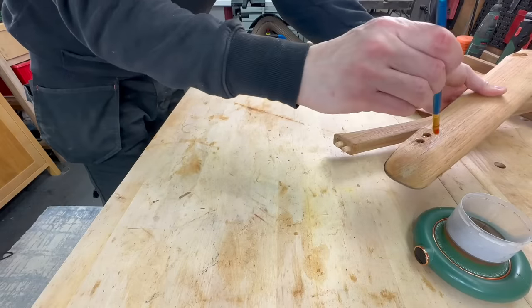To make some of those repairs, the dowels would have had to stretch from one edge of the piece of wood to the other, which wasn't feasible. So I made them as big as was reasonable and used a little bit of sawdust and wood glue or wood filler to patch up the little holes that were left. I cut a bunch of them in different sizes and different colors just so I'd have options to best match the grain.